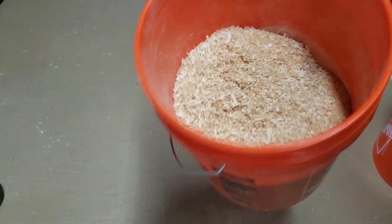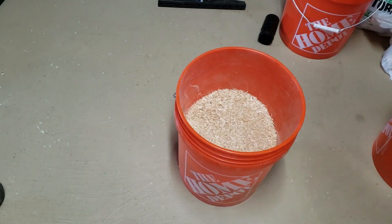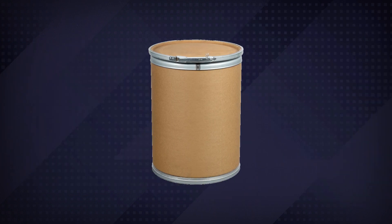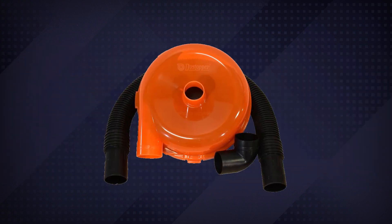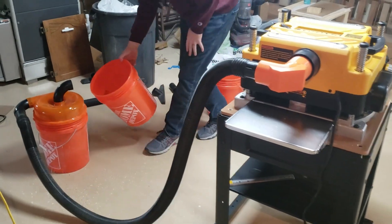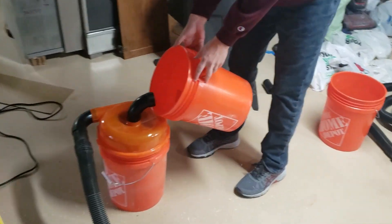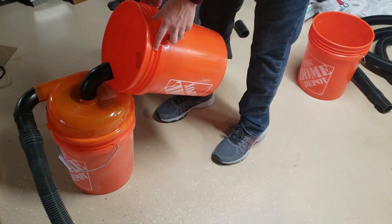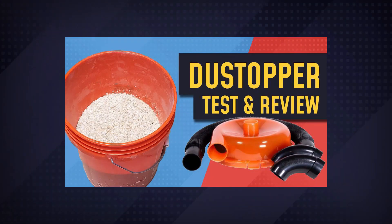If you plan to do a lot of planing, this probably isn't the best solution. You'll want to either look at getting a true dust collector — in which case you don't really need this adapter — run the output to a collection bin or bag — in which case you also don't need this adapter — or use a cyclonic separator to catch the dust first. That's what I did. I've got my handy dust stopper over here, and it catches about 99% of the sawdust. I don't even need to connect the output to my shop vac most of the time. If you want to see a full review of that dust stopper, just click the link in the description.